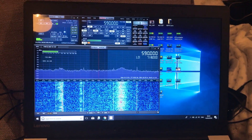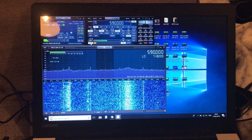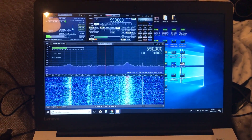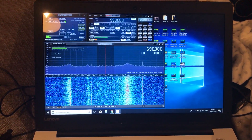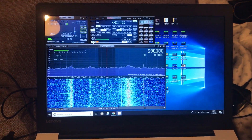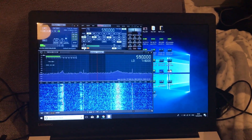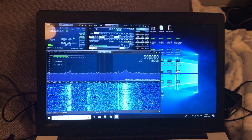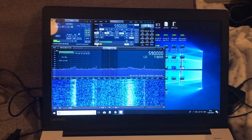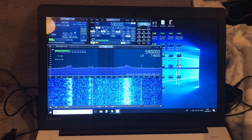Hi there. There was a bit of a debate going on on my channel earlier regarding the performance of the SDR Play using a medium wave loop. I surmised from its relatively poor performance that the reason is because it's not working on the basis of enhancement of an internal ferrite rod — it's using the loop antenna solely. The empirical evidence for me is that on any signal on longwave particularly, where I've compared the SDR Play RSP1A versus any portable, the reception on the portable is always significantly better.